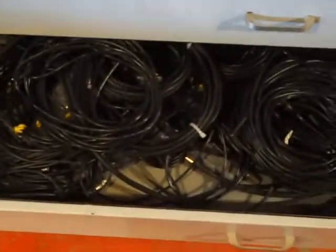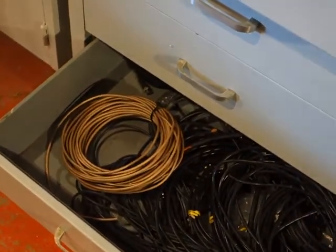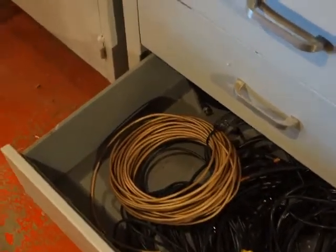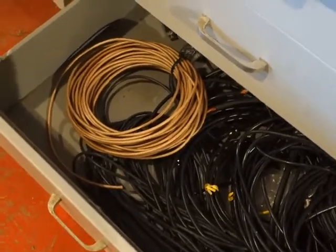And let's see, I don't remember. Oh, miscellaneous coax. Now that stuff there, that brown stuff, is really good stuff. That's RG142, I think. I got it somewhere. I can't remember where, Hamfest or something. And that's the good stuff. It's Teflon, double shielded. Use it inside repeaters.